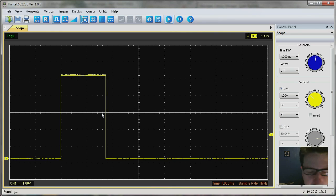And since we are oscillating, let's put in some derivative to break down the ball. Okay, so that didn't work at all. Okay, the gain is too high, so let's get it down. So there you go. Can't see the ball, but maybe you can hear it. It's slowing down now, so let's get up to 10 derivative. Okay, so it starts to oscillate again now.